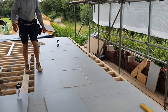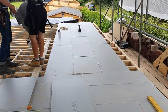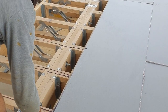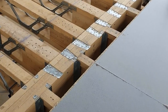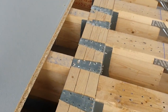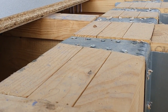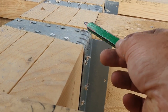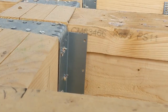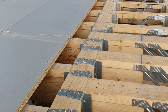You can just see Ed and Andy pulling a string line through for the glue. We always ping a line down so we don't over-glue every course — doesn't take a minute but keeps things nice and tidy. Where we've got this triple-ply beam, in the last video I spoke about letting in the hangers. Those are the hangers let in there — if you didn't let those in, when you get your floor running over the top, those nails and hangers would hold it up. So I simply routed those out so they're all below the line of the three-ply, and when we put the glue on everything will be nice and flat.